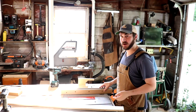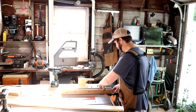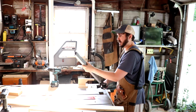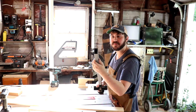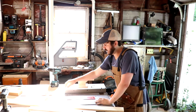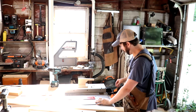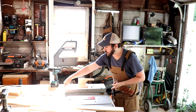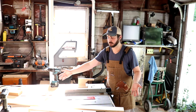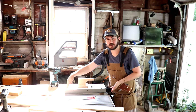The first hurdle I had when modifying the table saw fence was that originally, you can see this part of it, originally it had an end here that clipped onto the back of the table saw, and that prevented the end from swiveling back and forth, and had one long bolt all the way through, so that when it did this, it clamped on both sides, making the table saw and the fence itself tight to the table.